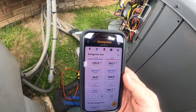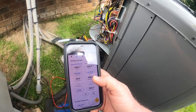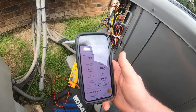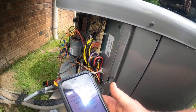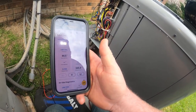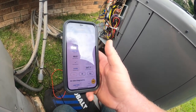On a heat pump at 70 degrees outside, the air coming through the condenser is a lot warmer than regular heat operation, so you're going to run those pressures up a little high — it's absorbing a lot more heat. Most heat pumps have a baseline operation temperature around 45-47 degrees outside — at that temperature a 3-ton heat pump gives you roughly 3 tons of heating, about 36,000 BTUs. Every 10-degree drop in temperature you lose about 10-15% of heating capacity, which is why you have heat strips for backup. Every 10-degree rise above that baseline, you're pulling in a lot more heat and pressures go up.